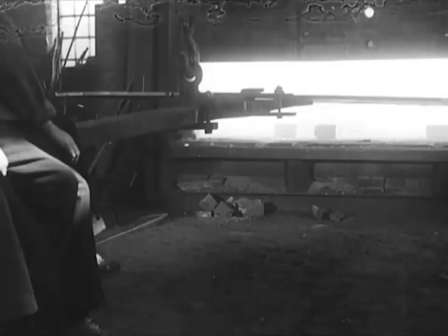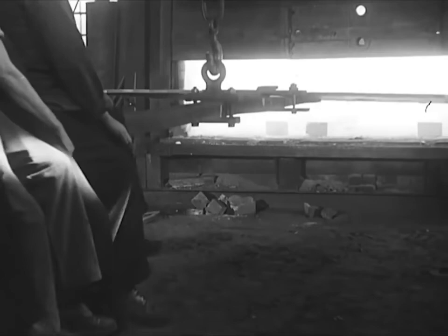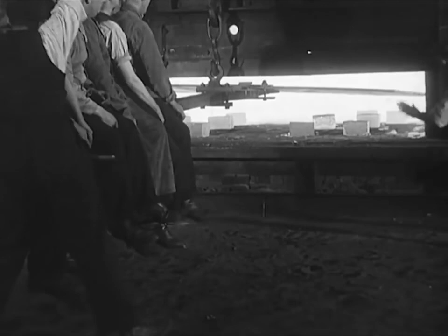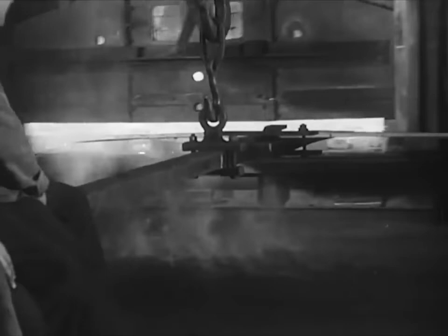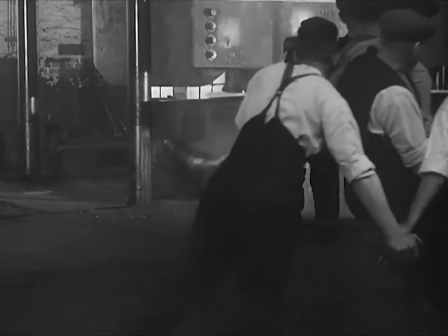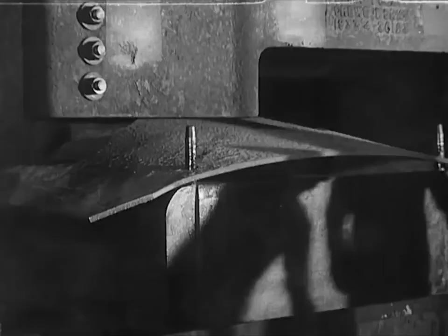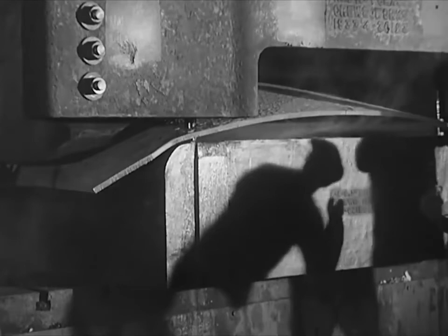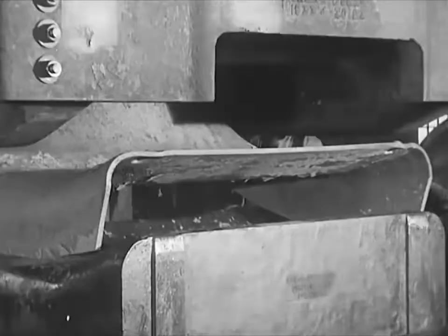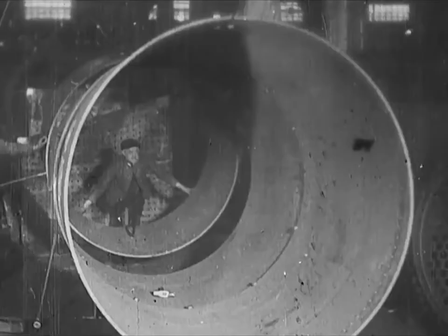To many a boiler is just the round barrel part seen on any engine running about the line, but many are the mysteries hidden beneath its rounded sides. The plate just going into the furnace is the bottom half of the throat plate, or the saddle plate as it is sometimes called; its purpose is to join the barrel to the fire box. The gas fired furnace soon brings the plate to the required heat, and it is craned rapidly to this huge press capable of exerting a pressure of 700 tons. The blocks between which the plate is squeezed themselves weigh 41 tons. Batteries of machines, each designed to do a particular job, cut and drill the various parts of the boiler, searing through the tough steel as though it were cheese, until finally they are ready to be assembled.